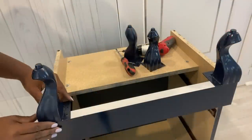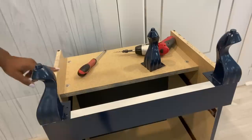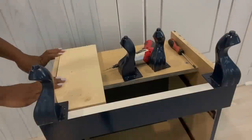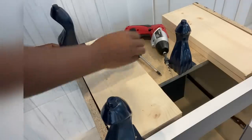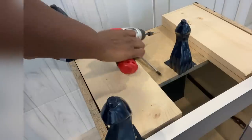The bottom of the nightstand is not covered all the way, but I was able to attach the two legs that are in front. The two legs that are going to be behind might not sit well, only because there's nothing there to support the other side. So what I'm going to do is add a little bit of height — I'm going to use leftover wood that I have at home and glue them onto the bottom. Now that I have the height that I want, I'm going to be attaching both legs that are at the back.